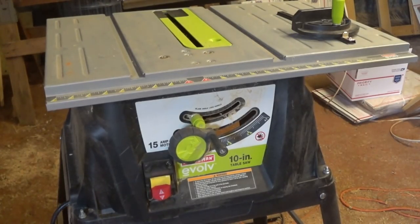For around $100, you're really going to get something that will handle most homeowners' needs for occasional use. I've used this particular saw to rip stock for cabinets, table tops, and that sort of thing, and it does a reasonably good job as long as you're careful with how you set it up. Always keep your fingers clear of the blade, keep the blade down when not using it, keep the saw unplugged, and periodically put a square to it to make sure all your guides are accurate.